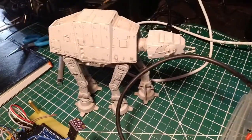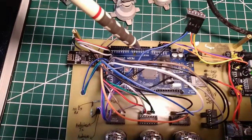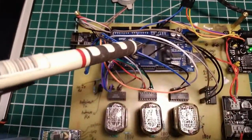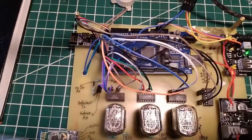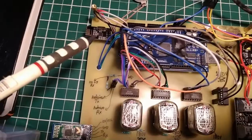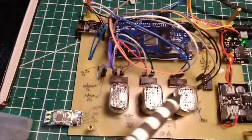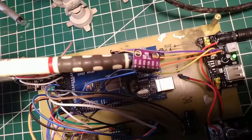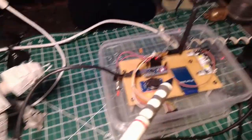This is the indoor unit, controlled by an Arduino Mega — necessary because the Nixie tubes require a lot of GPIO pins. It has another NRF24L01 radio to receive data from the outdoor station. There's also a BME280 sensor on this unit to record indoor data, which is transmitted back through the radio to the outdoor unit for SD card logging.